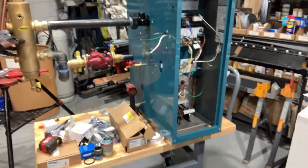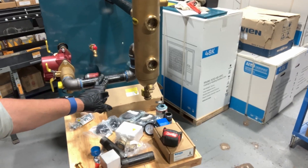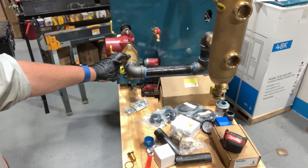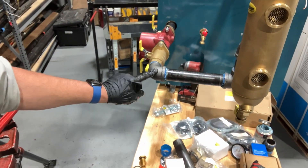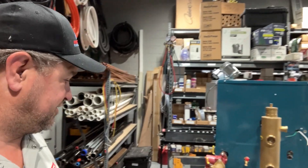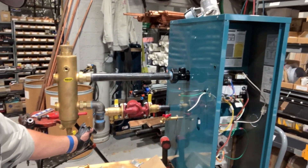It took some finagling. My nipple — I needed to tighten it up because the eight and five eighths I cut was more like eight and three quarters. So I took off the bolts holding the isolation flange with purge from the circulator, threw it in the vise, tightened up the street 90 going into the nipple, and the regular 90 going into the nipple. Made it up, and now she looks pretty good. Let's trim out the rest of the hydraulic separator and put a piece of threaded rod right there to hold it up.